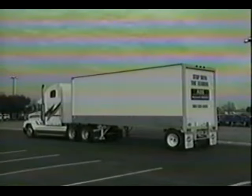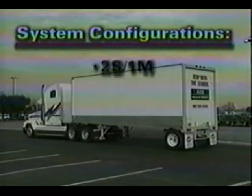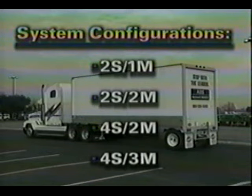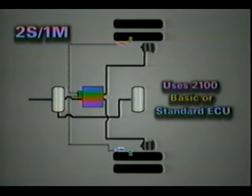Now, let's look at the various Easy Stop system configurations. The available configurations include 2S1M, 2S2M, 4S2M, and 4S3M. The S stands for sensors, and the M stands for the ABS modulator valves. The 2S1M configuration uses two wheel speed sensors and one ECU valve assembly. The ECU monitors wheel speed on one axle only. This configuration uses either the 2100 basic or the standard ECU valve assembly.